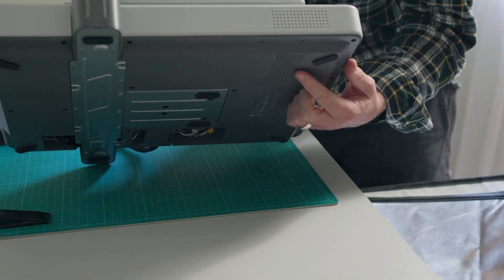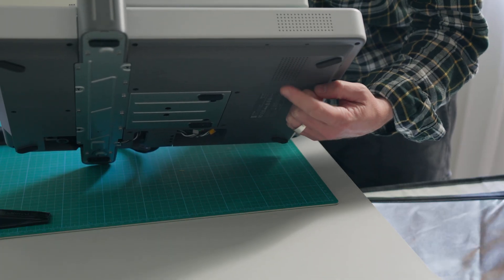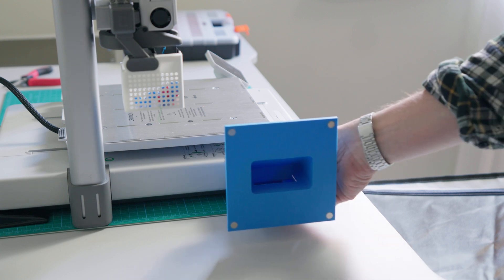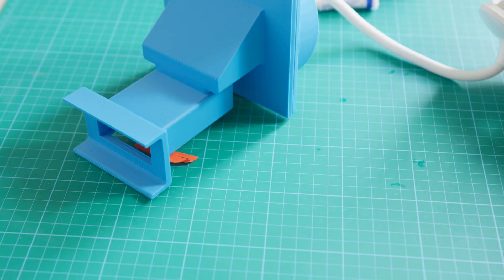So let me walk you through it. On the front sides and bottom of the A1 there are these little intake vents. I don't know exactly what electronics are kicking around in here, but my assumption is the motherboard is somewhere down here. My thought process was to direct airflow from the outside of the case to the inside of the case, hitting this vent on the left-hand side of the printer. That'll kick air into the A1 base housing, and then a little air redirect underneath will push air under the whole device — sucking its way through out into the air purifier tent from the former double suck method. So in theory, we now have fresh external air being channeled underneath the A1 and not across the print bed.